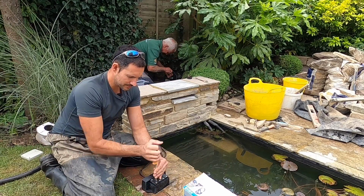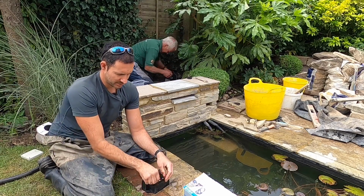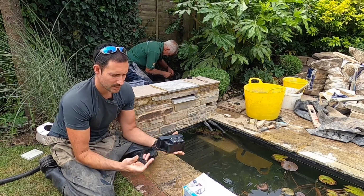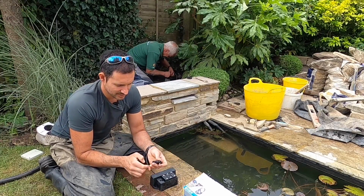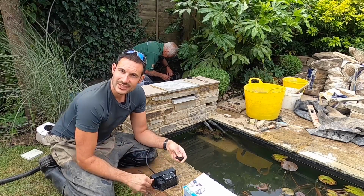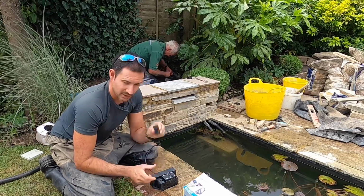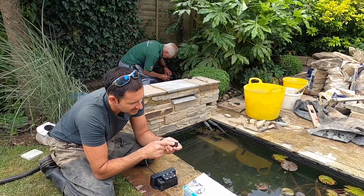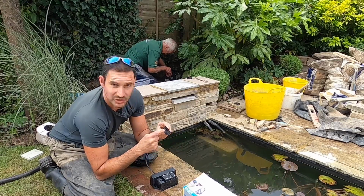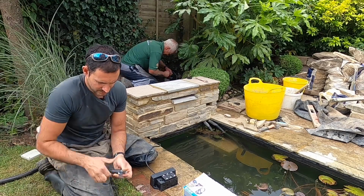Very simple to install these. It comes supplied with some blanking covers that simply unscrew from the transformer, like so. And these are, well, they're important to hang on to, because this is what is going to blank this off if you wanted to create a waterproof connection by not utilising all 4 of these sockets. So very important that you keep those. And you'll see it's kind of impregnated with a rubber within this socket, and that's the same on the end of the lead socket as well.